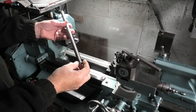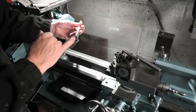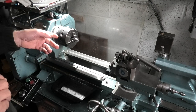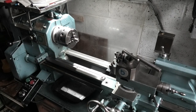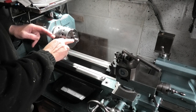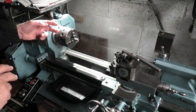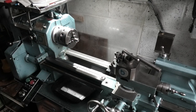My test bar is about 13 inches long, 15mm diameter, silver steel. All I've done is face it off and put a centre in each end. If you haven't got a full length of silver steel you can use any type of steel — you need to turn the diameter so it's running true on the end. On this piece of silver steel I need to face it off and centre drill it, but before I do that I need to make sure it's running true. It's a three-jaw chuck but you can alter the centre position to take out any runout. I'll put a dial indicator on here to see how true the silver steel is running.